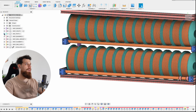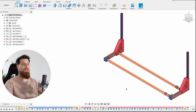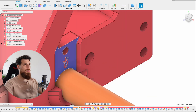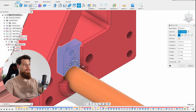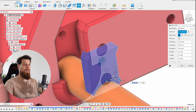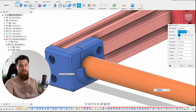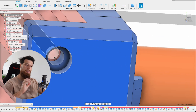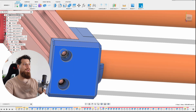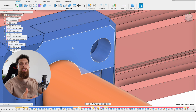Let me show you how it looks without the filament. I kept the bottom bracket in place - the one we are actually going to build today - so we can check in more detail what's behind the project. Here you can see in red this little piece with the logo on it. This will be the fixing mechanism for our rod. You place the rod in there, then this piece comes right at the end of the 3D printed part, and here there will be a screw that fixes it in place. On the front side there will also be a fixing mechanism for the end caps. These two holes align with the center hole of the aluminum extrusion, which will be threaded so you can screw directly into it. There will be a metric M5 slot in there as well, and the locking mechanism also clamps the rod while securing the end cap to the aluminum extrusion.